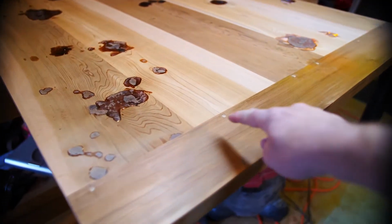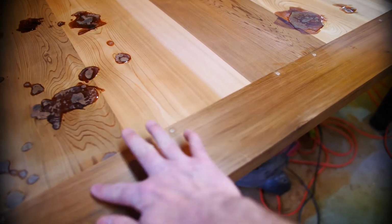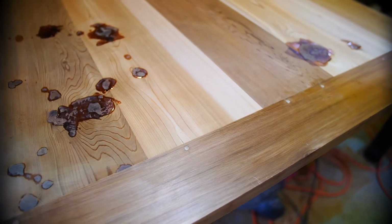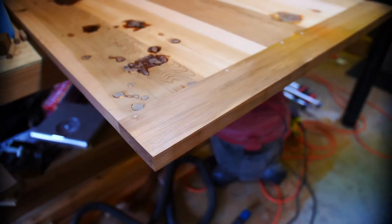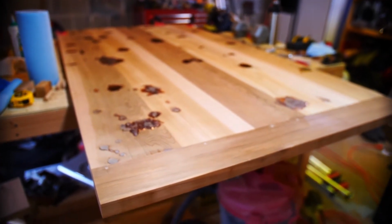And then I went ahead and drilled a 1/4 inch and ran a dowel in it and used a small handsaw, a little flush cut. It's kind of like a Japanese saw, but cheap version, to cut these flat. And then I'll sand the whole tabletop flat. I wanted to get the epoxy sanded off, and then it'll be teak time.